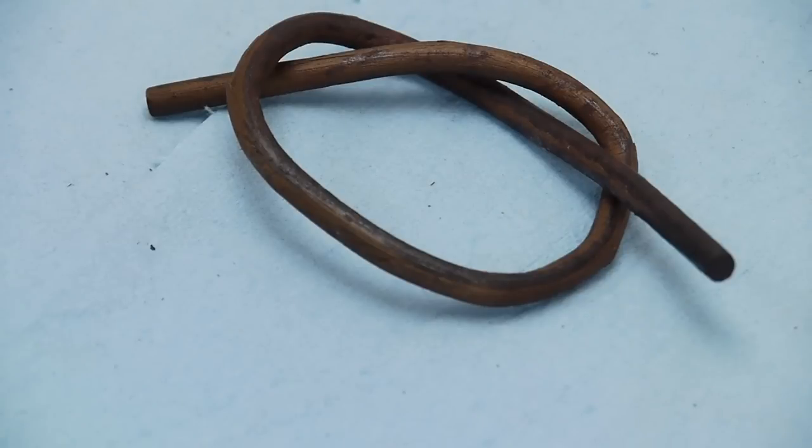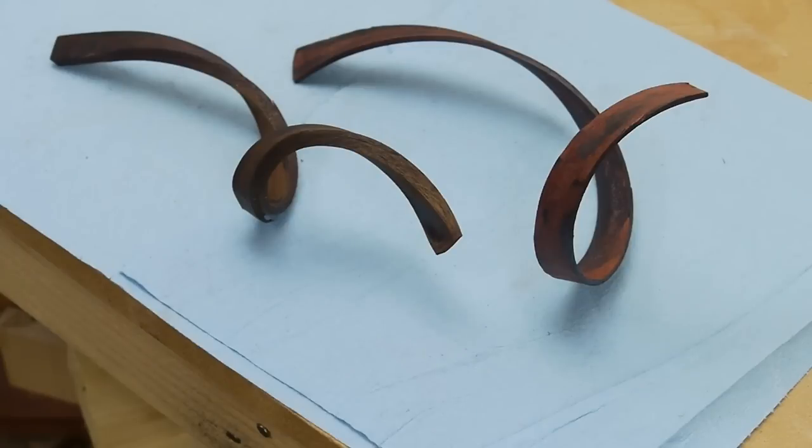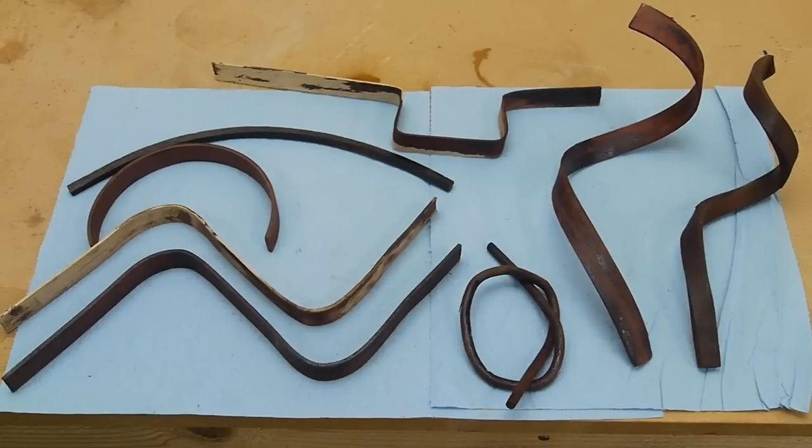The reason this process works is because the ammonia interferes with the molecular bonding inside the wood. The thing that gives wood its structure is lignin and cellulose, manufactured by the plant to provide structure. It seems the ammonia gets in between the hydrogen bonds in the lignin especially, taking the place those hydrogen bonds normally would between different parts of the lignin molecules. This means the molecules can slide past neighboring lignin molecules — you've basically unglued the wood from itself. Once the ammonia leaves, all that hydrogen bonding resumes in the new shape, and now you have a stiff piece of wood again in the bent form.